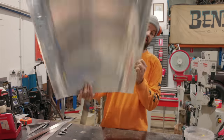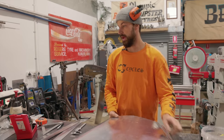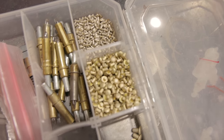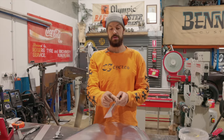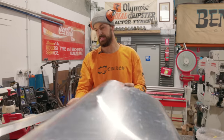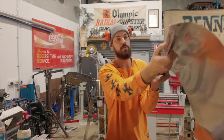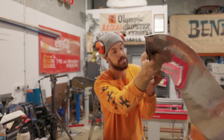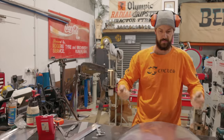So I've already drilled those out, and on the back side, I've just cleaned all the burr off of it. I'm just gonna use these real tiny little dome head aluminum rivets. I'm making up a couple of these, and they're just a simple U-shaped channel that will go up inside like that. Once we clamp this down, it's going to take that little bit of bow that's in there out, which will be really nice, and allow again for that weight.